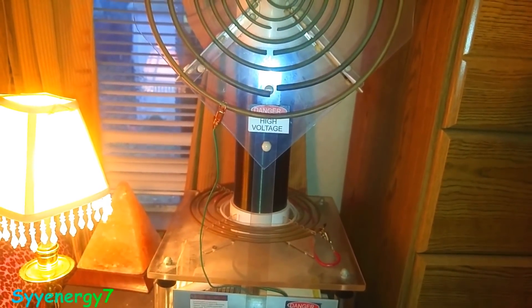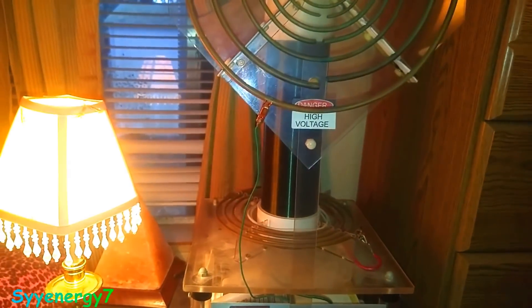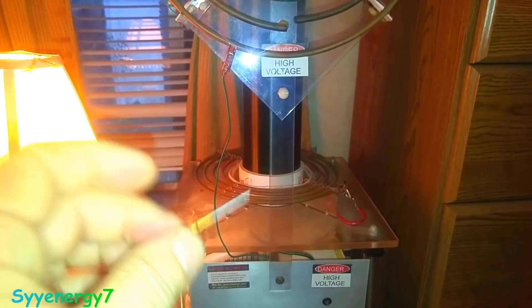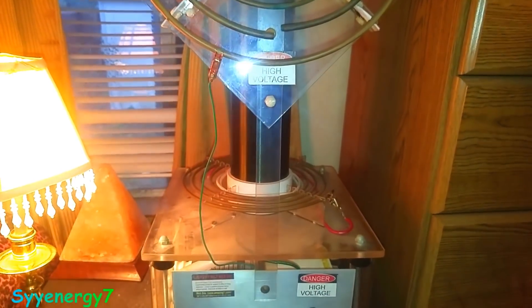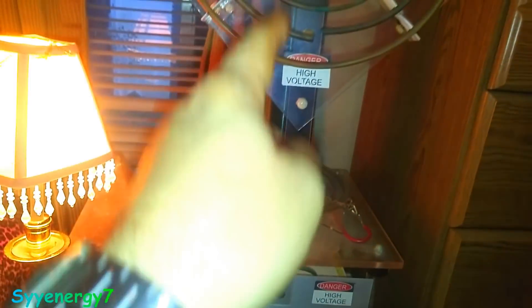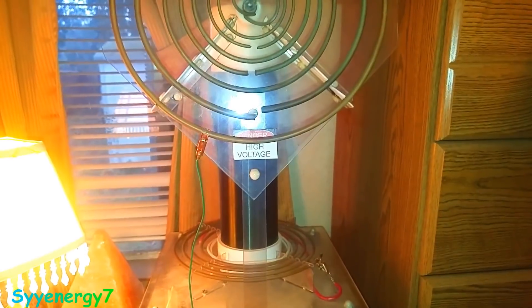What I did was I used a drill bit like that to set the gap — it's the easiest way to do it. In the back there's a couple of tungsten rods with a couple of screws, and they wear out after a while. That makes your spark gap for the Tesla coil.